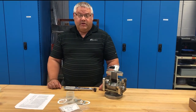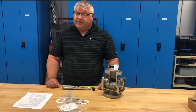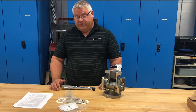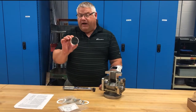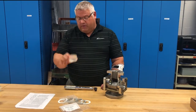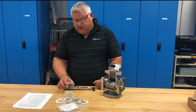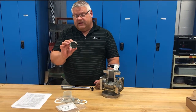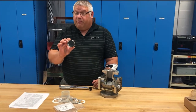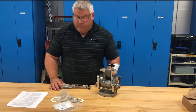Three simple rules will help lead you to success in your application. The first is to ensure that you always use new parts. Glass must never be reused. Glass that looks perfectly fine coming out of an assembly contains the stress from the original bolt load applied when it was put together. That nice clean looking glass placed back in service can immediately fail during reassembly or at some future unknown point. So it's important to always use new glass when rebuilding.